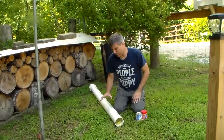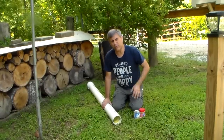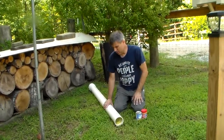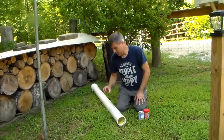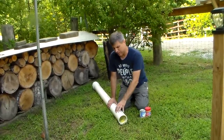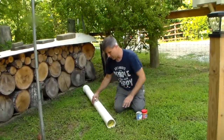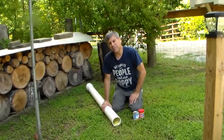Normally pipes in a house are three or four inches to accommodate for the sewer. Use what's in your house so the sizes will match. Also use the same kind of piping, the same quality — make sure it's the same. Don't use the really thin sewer pipe compared to the heavy schedule 40 PVC.